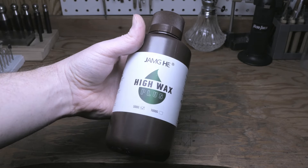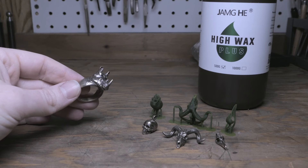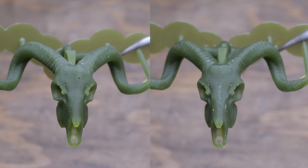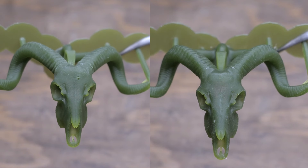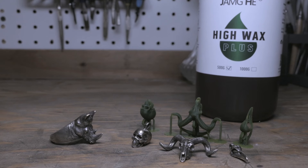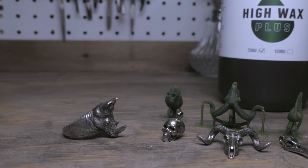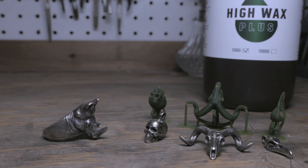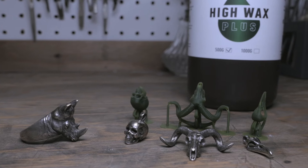For my final thoughts on this resin, I'm actually very impressed with how it performs. These are some of the cleanest castings that I've been able to get with a castable resin. After some tweaking on my printer settings, I was even able to fix those problems of getting small holes in my print by just changing the layer height to 0.03 millimeters. If you're interested in trying this resin for yourself, they also gave me a coupon code to share, so be sure to check that out down in the video description. I'm definitely going to be using this resin for some future projects, but until then, thanks for watching and I'll see you in the next one.